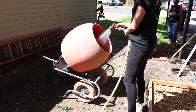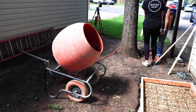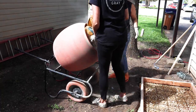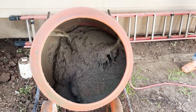To begin the mixing process I first added water to the empty mixer. The concrete bags we got were 80 pound bags so it took two of us to carry them over and into the mixer. I'd make the first bag extra wet so the second added bag had a good moisture consistency to mix into.